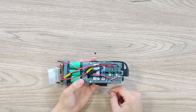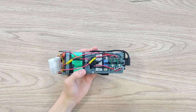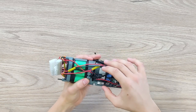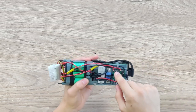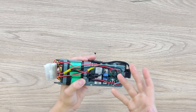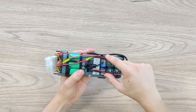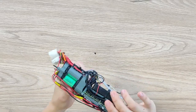On the bottom there are also a couple of minor circuits. This power MOSFET allows the drone to turn on when you plug in the tether. There is also a fuse connected to the MOSFET for safety. And then there are two LED drivers which control the main lights on the CPS drone. That's basically the entire electronics.